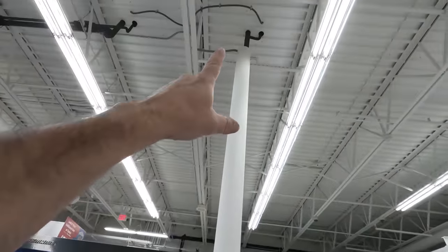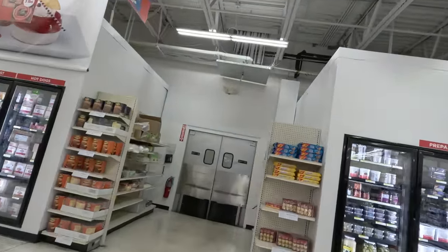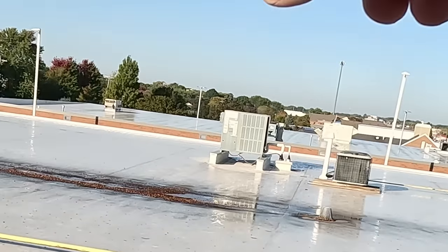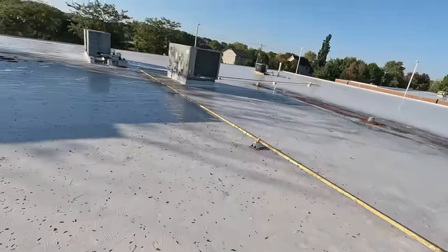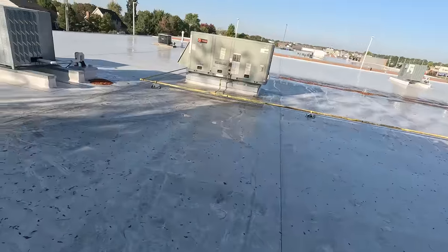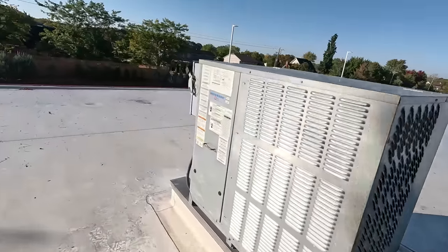You can see this goes up through the roof, so over here in this corner you can see where the rack goes up. This is one of the few I've seen where it's on the roof — it's not normal around here. I ended up having to do some work on this one right here, which I don't believe I made a video on. That was just a bad compressor. And over here, this is the rack, which most of these are on the ground where I'm at. When you went in there and looked at the Emerson controller, it said not on the rack. You've got one case here that's got fresh meat in it and it's working okay, and then you've got this one here that's not running.